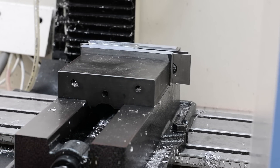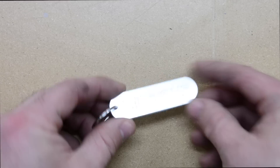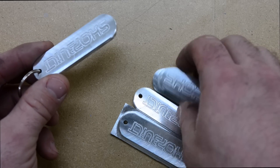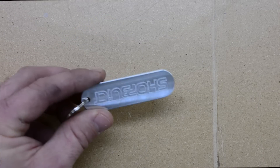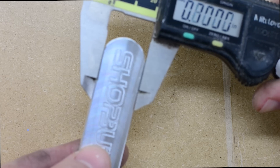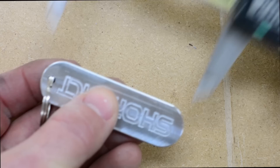That's it for the second operation. Let's take this thing over to the bench and have a closer look at it. I should also mention that most of the footage you watched was sped up at four times, but cutting out this complete part takes about 11 minutes at least at the feed rates I'm going right now. I've been doing this quite a bit this week — as you can see, these are all trial pieces. I've been really focused on trying to get the machine dialed right in to cut exactly what it's supposed to cut, and of course figuring out Fusion 360 and the machine itself takes some practice. I think I'm getting there — it's not perfect yet but well on my way. This is supposed to measure 0.8 inches and I'm showing bang on, and in this direction it's supposed to be 2.8 inches — and I'm just a hair under. So it's cutting pretty accurately.